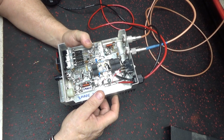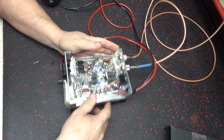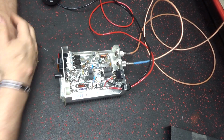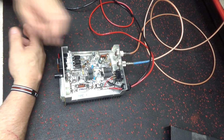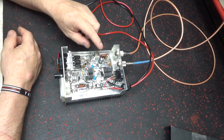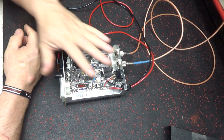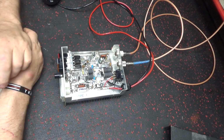mud puddle water. It was pretty muddy. But she cleaned up. I cleaned the front of it up. She's clean. Run it through the sink and took the top off that and blow through it. But you got to watch how you blow through this. Blow easy because you can mess up those relays. Try to keep the air way away from it and don't put a lot on it, but dry it out.